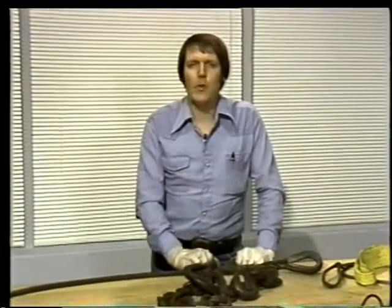This brings us to one of the general rules of rigging. Slings should be rigged so they're within 60 degrees of vertical. Any more than that, and you stand a good chance of overloading your slings and snapping them. That means that when you're selecting slings for a rigging job, they have to be long enough to make that 60-degree angle. If they're too short, they'll be too close to horizontal, and the extra tension might break the slings. Little things like this can make a lot of difference when you've got 8 tons of metal overhead.